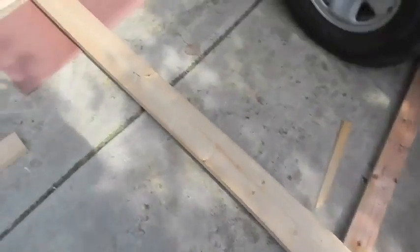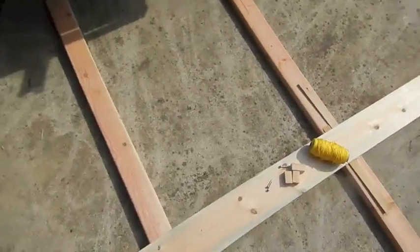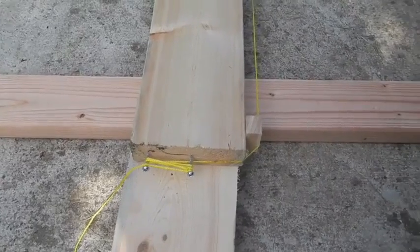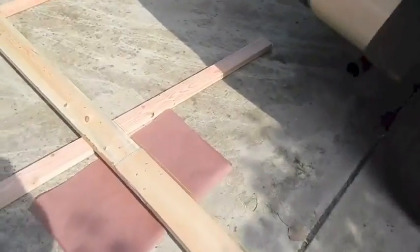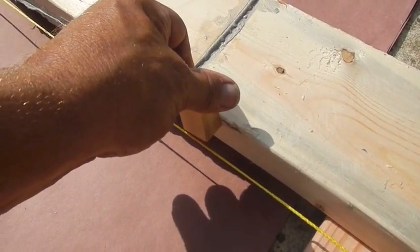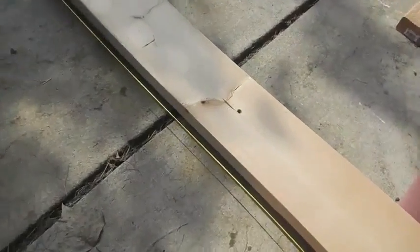All the way to the other end, I'm going to attach a block here, run the string down the length of it to the far end. Take the middle block and check it for straightness. See where I've got the string attached — the block runs parallel with it. Double screw makes it easier to keep it tight. I haven't checked it yet, so I'll be interested to see how this goes. So I've got the third block in my hand — look at that. I did it by eye, and I tend to trust that, and apparently I've got a pretty good eye.